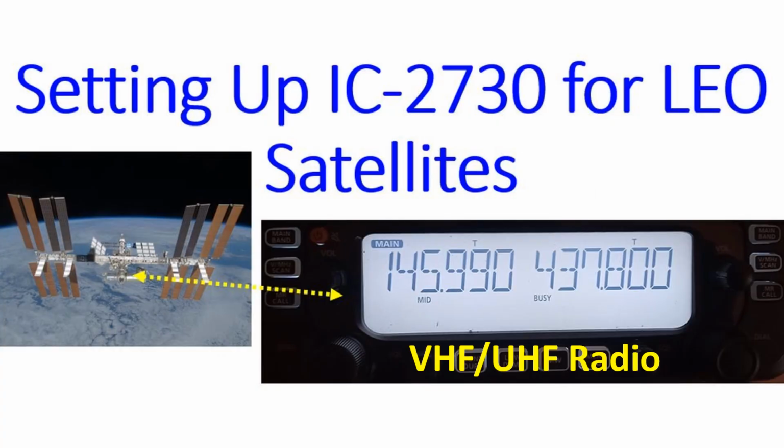When I acquired a new radio with VHF and UHF capability, I started experimenting UHF with my local friends. All I could reach is just 1 kilometer on UHF or 436 MHz band. Then came the possibility of satellite operations when a local low Earth orbit LEO satellite repeater contact group was formed. FM satellites are LEO satellites with cross-band repeaters. Easiest one to work is the amateur radio on International Space Station, known in short as ARISS.